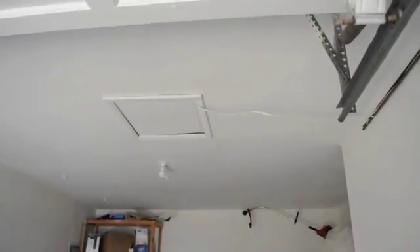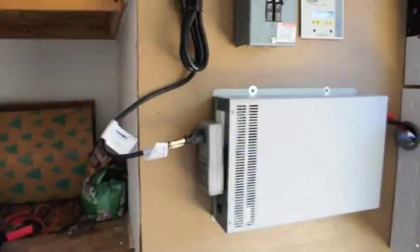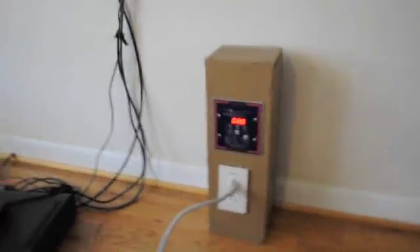I'm bringing in 6 amps right now. I've also got a kilowatt meter here which tells me how much I'm using — right now it's showing about 63 to 65 watts going out to the house. I'm just running my computer and some lights. It's wired via a three-prong extension cord up to an AC breaker box, with two breakers — one running to my living room and one to my master bedroom. Those cords go down into the living room and up into the attic.